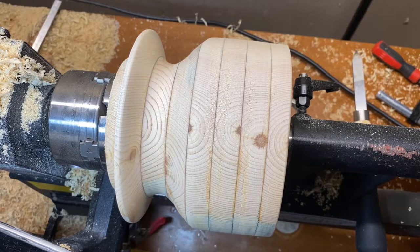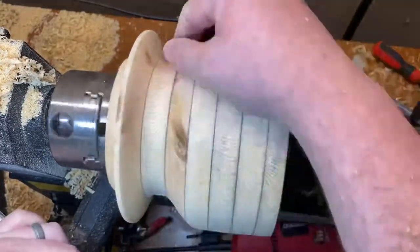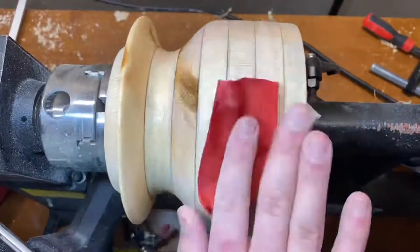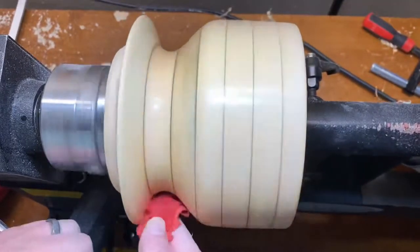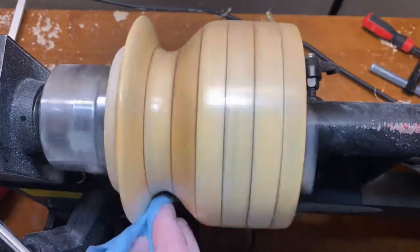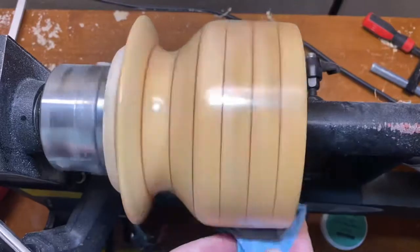I don't ever film all the sanding because sanding to me is kind of boring - I think it's boring for everyone to sit there and watch, kind of like watching paint dry. So I just show a little bit of it, then skip ahead. Now that we're done sanding through 400, I'm putting a coat of sanding sealer on here. The outside of this wood shined up really nice - it had a really good shine just even with the sanding sealer, almost looks like it's polished. Burnishing that in a little bit, then going with the Axe Abrasive Sanding Paste again on the outside, and finishing up with the Axe Polish and Restoring Paste. You can just see that shine on there - looks really good.